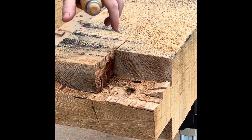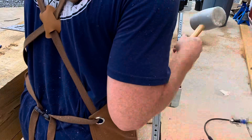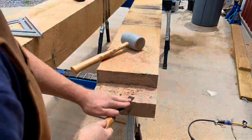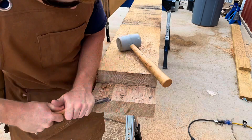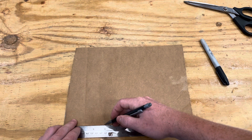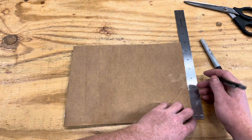Here's what that looks like at a faster speed, and here's a slightly longer clip showing the cleanup process. You do have to get things square — it's really important to double-check your measurements and your square, because it's really annoying to have to go back and redo it, especially when you're trying to assemble everything, because that's when you'll find out. I take a hand plane at the end to clean everything up and make it really square and tight to the lines I draw.